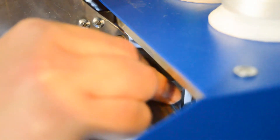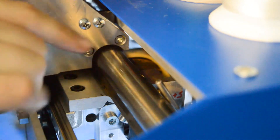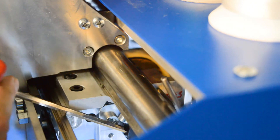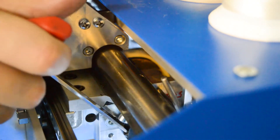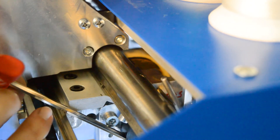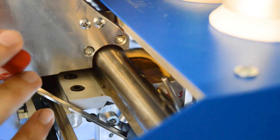Once you've got the pin into the machine it needs to be into the metal cam at the back. Now if when the pin is in and the machine is not reading the correct number — in this machine it's 136 — then we need to make an adjustment. So we'll take our 4mm allen key and loosen the black screw on this black collar here. Hold on to it and then turn your tool at the end of the machine so the machine reads 136.